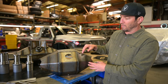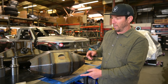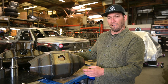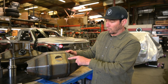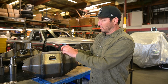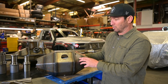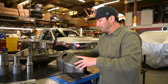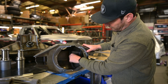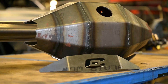We have three pieces to the center section here, and underneath this well, this thing is internally ribbed. When we put this together in our fixture, the way we have the ribs inside, this first weld right here dives into all the material. The weld hits the two pieces here as well as the back side of the rib internally. That rib inside then gets fully welded inside as well, so there are actually three welds touching that rib.